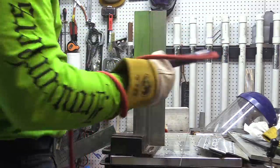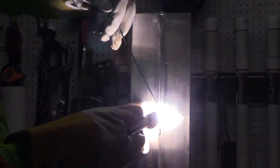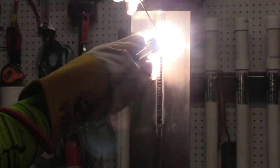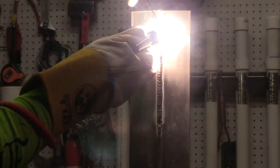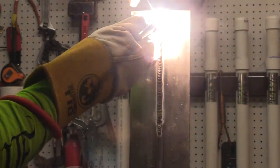The first one of these I tried didn't turn out so well, for two main reasons. Part of it was just me being out of practice, and part of it was cleaning. My first try, I just tried holding the torch sideways and it felt awkward. I also knocked the edge clean with a flap disc in a hurry. You can see a line in the very center — it's just pushing a layer of oxide through the backside. A flap disc can swirl and bury existing oxides into the aluminum, making it really hard to get a good-looking penetration side. I should have known that. That, combined with not having done this in a long time, just took me a while to get back in the groove.